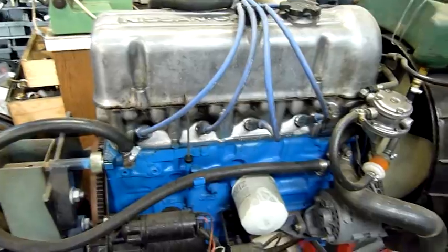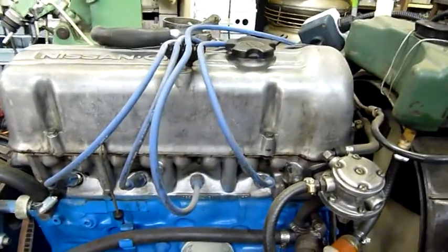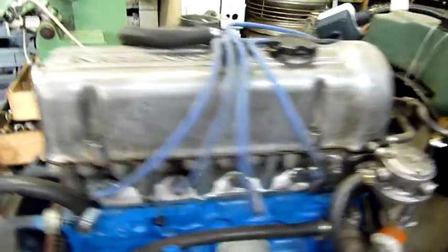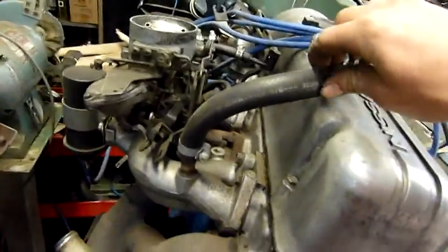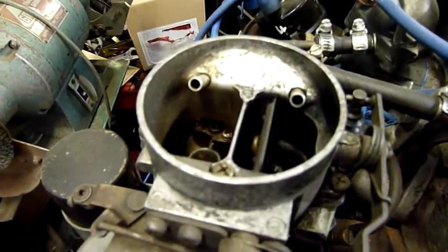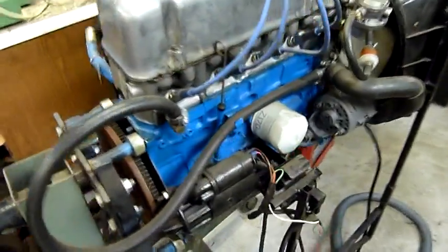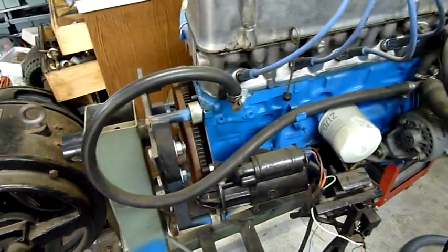Overall it's not a bad engine. I did notice it was sticking a valve at one point — the compression sound on cranking just didn't sound even anymore, so I think it just needs a good run. Typical of a backyard engine. The carburetor was covered when it was stored but there's spider webs and things still in there. Yeah, not a bad engine overall.